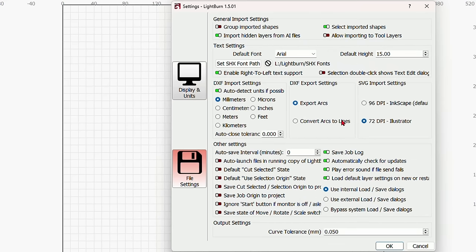you'll never know exactly absolute coordinates without burning a grid into a wasteboard. And then once you do that, you really can't cut, because if you cut through the material, it'll cut through the wasteboard grid as well. So I'm going to show you, if you have a honeycomb, how you can do it from any position. But in the meanwhile, it's going to finish this engraving, and then we'll talk about the reason that I can engrave over a painted surface without any issues whatsoever. And I'll show you that in just a moment.